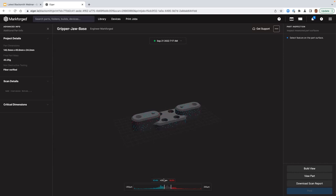You can hover over the histogram to see each bar's values, or click on it to show only points that are outside your desired tolerance. The default scan point deviation bars are mostly centered because we're looking at signed scan point deviation. If you click on the histogram title, another menu pops up with two options. Selecting absolute means you're no longer concerned whether the scan point detection is above or below nominal — you're only measuring how far off from nominal you are. You can also switch between surface point deviation and scan point deviation views.